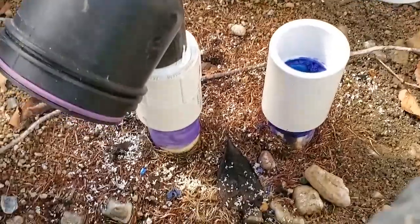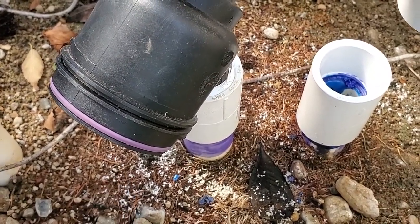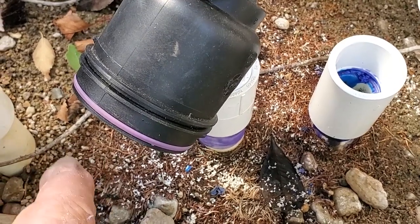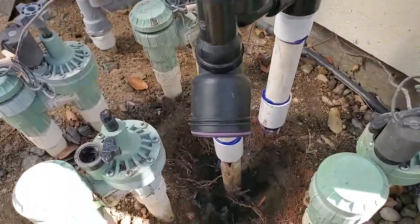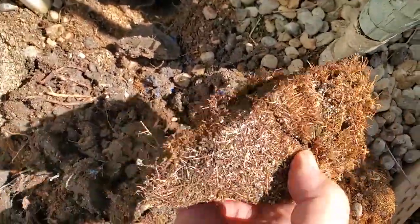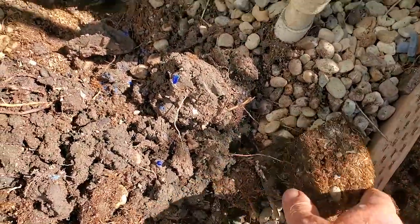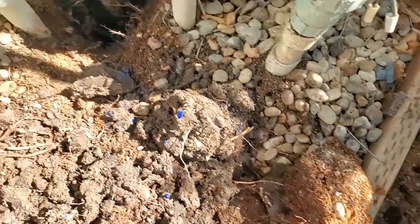I'm going to have to dig this out and see if I can pull this vertical pipe in this direction. If not, I'm going to have to dig down far enough to cut the 90 down there and cut a section of the horizontal pipe off so I can move the assembly. I dug all this out — these are fibrous roots that had grown around that pipe. When you have a slow leak like that, this is what forms over time. It probably had been dripping for many months, if not a couple of years, to get like that.